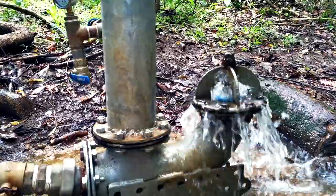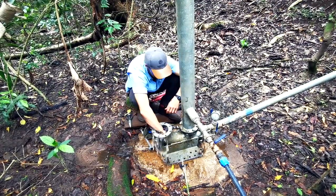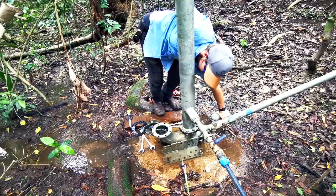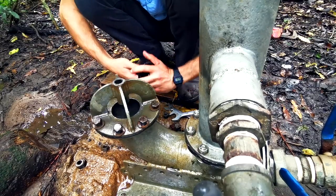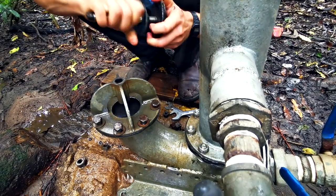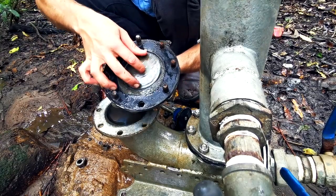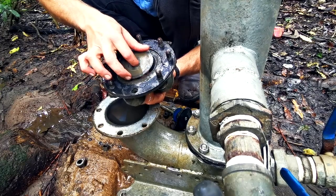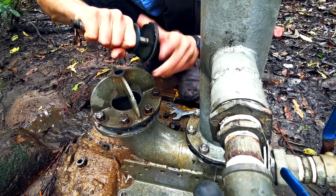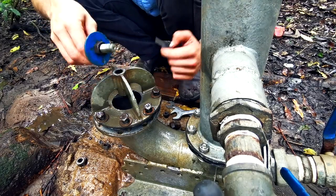And that's what it does — it does this 24 hours a day, 7 days a week. As long as you have your reliability, it's good. I'm sitting up here and basically the way this valve was designed hasn't worked out entirely, because what I found was the metal-on-metal seal underneath here, even though it's seated, wasn't completely fitting. So it wasn't sealing shut and you were getting this squirt of water coming out and it was really affecting our efficiencies. So I went and got this machine belt built, but it turns out that every few months we've got to change this out because what starts to happen is it splits. So today we're just going to change out this machine belt and hook this guy up again.